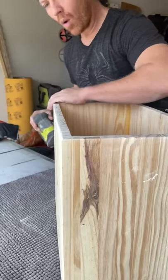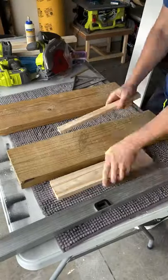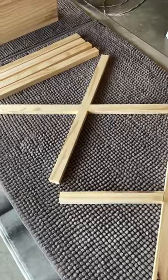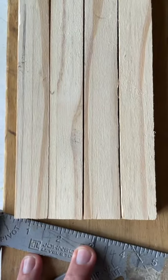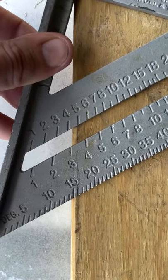To create the legs, cut the one-inch strips so that you have four 16-inch boards for the legs and four 20-inch boards for the cross braces. Line up the four 20-inch boards together with the one-inch side facing up and stagger them at a 15-degree angle using a square.